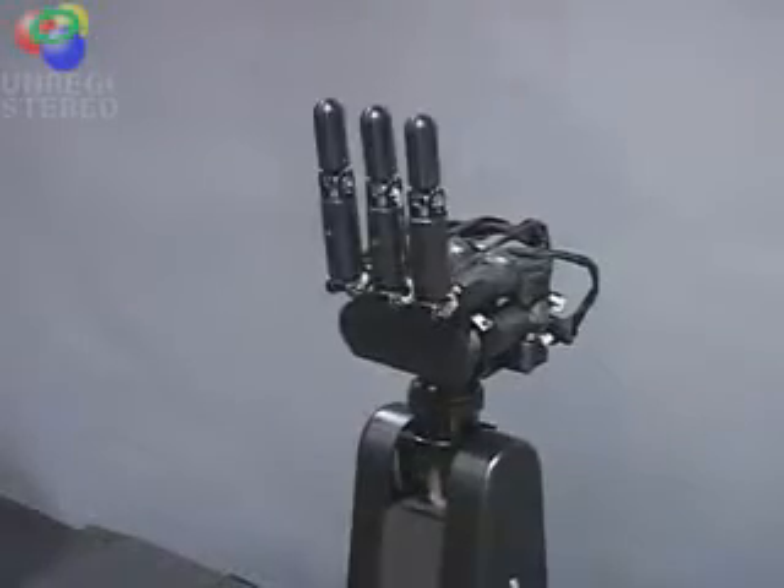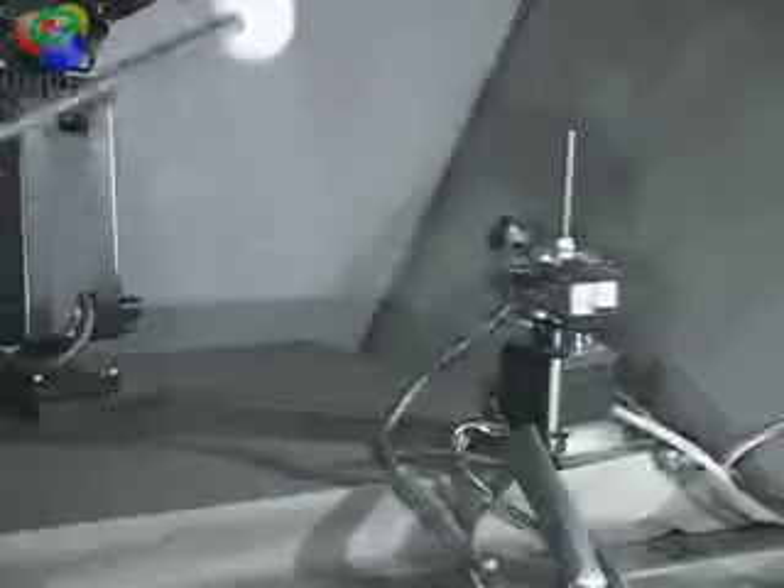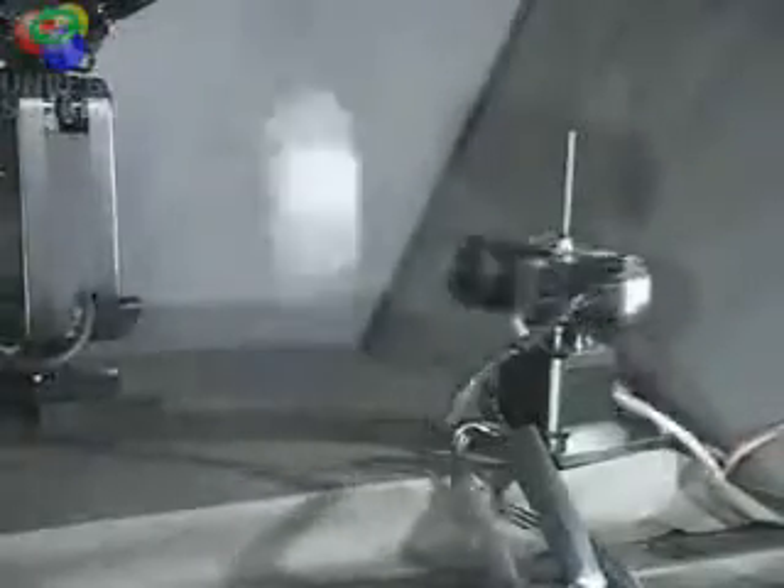The hand can close the joints at 180 degrees in a tenth of a second. The vision system consists of 128 by 128 photo detectors and an all pixel parallel processing array. Using the vision chip enables various image features to be computed within one millisecond.